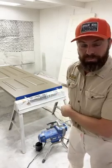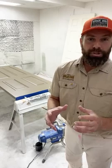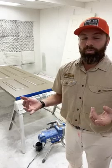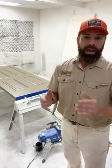We can use Emerald Trim Urethane. We can use any number. Sherwin-Williams has tons of products for that sort of thing. Typically, we'll just take a really good brush and brush those things. For brushing enamels, we'll use a Purdy Nylox, a Sprig. We'll also use our standard wall brush, which is a Pro Elasco, which is a 2.5-inch straight cut with a nice long handle.